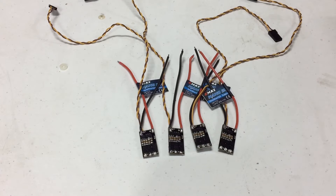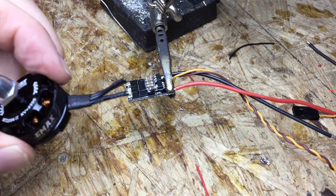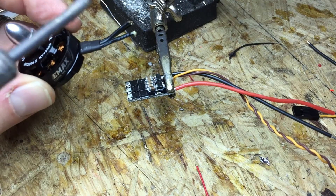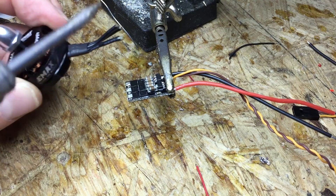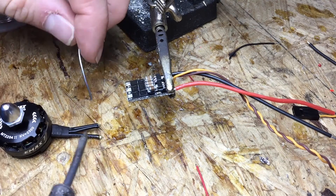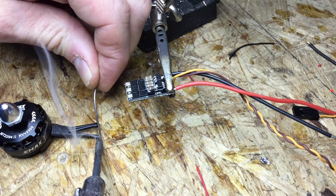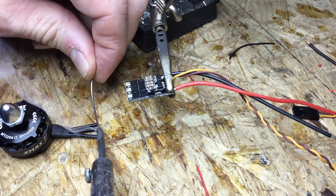Next up I'm going to measure out the wires and get the motor wire soldered. I'll show you how I'm tinning and setting this up because sometimes people ask how I solder. I've got some flux and I've dipped each tip into flux. You can see I just have a little wire showing — you don't want too much extra because it just runs over. So I've got it tinned and I just put my soldering wire next to the wire with some solder for all of them.